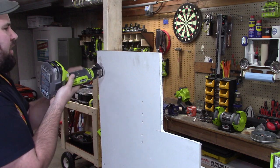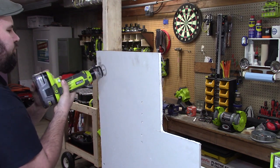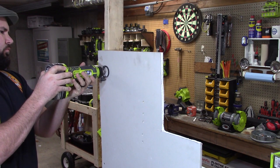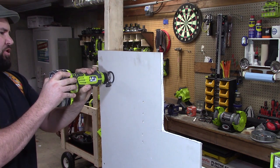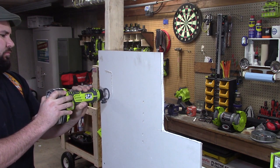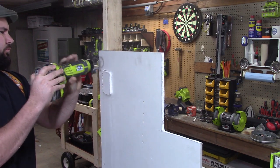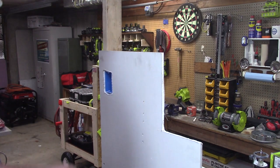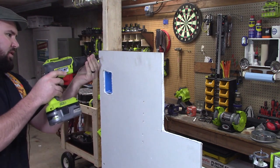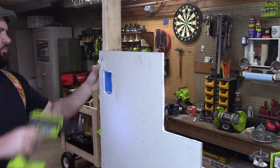This is 12 and three-quarters — we're going to go in. I know that the box is right along the stud here. We're going to go to the known point, apply pressure on all sides — and there you go, you've routed out the box and it sits right on. You can then go ahead and put your screw in and you're good to go.